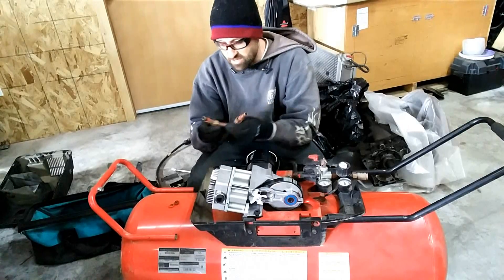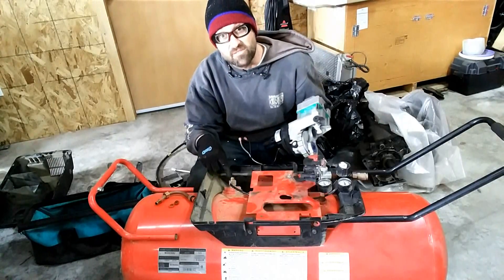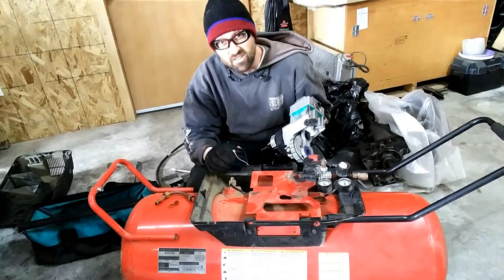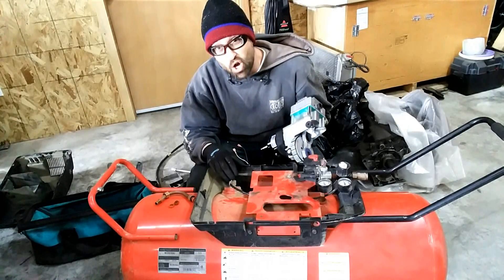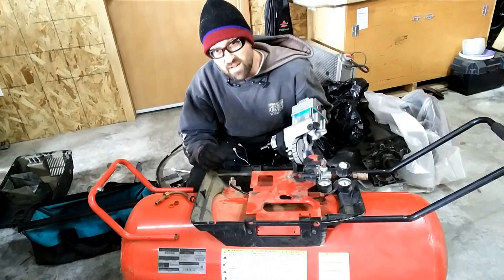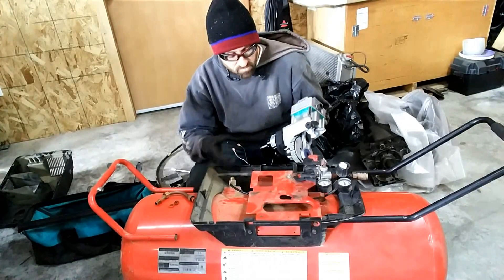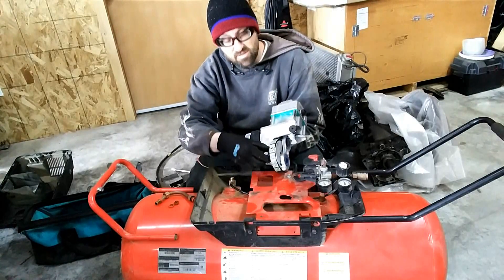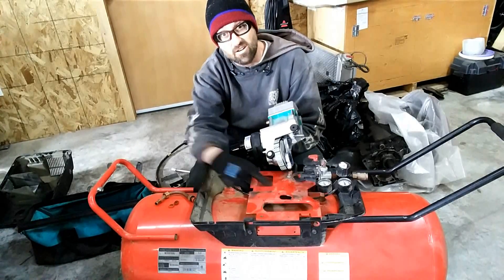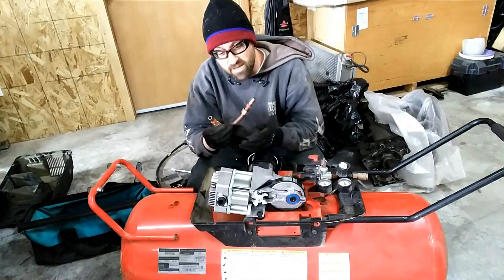On your compressor end, if you look down in there, there's going to be a small metal screen, and it's probably going to have some dirt and other stuff in there. That's to help keep stuff out of your line, but eventually it will clog if you've never cleaned it. So now is a great time to clean it — you can almost blow on it and a lot of that stuff comes out, but you might take a Q-tip and get the rest of it out. Now to assemble this: right by there you're going to have this rubber grommet next to your wheel. This is your belt — it's going to go in the slot towards the back. Slide it in and then slide it up. Once you have that done, it's time to put your tube back on. Just fit it in both sides because everything's loose.